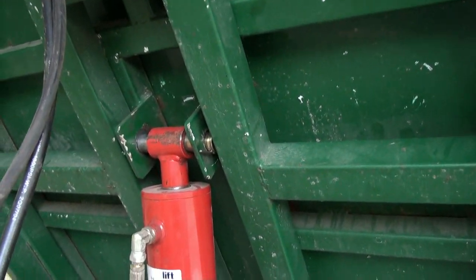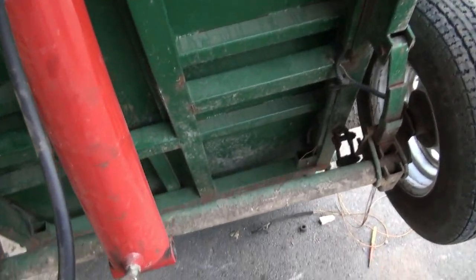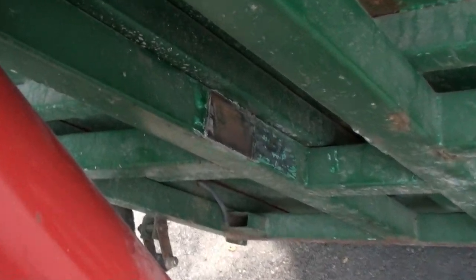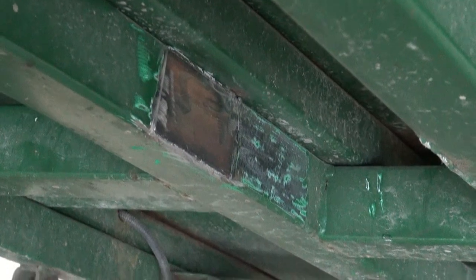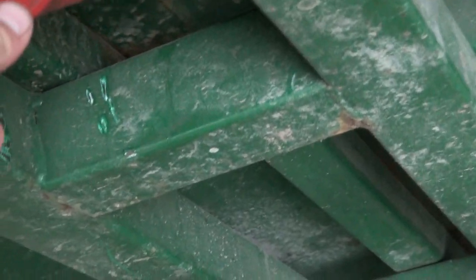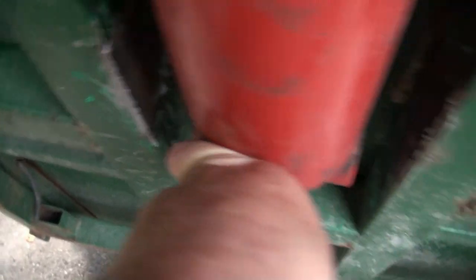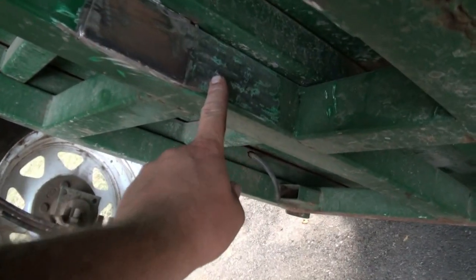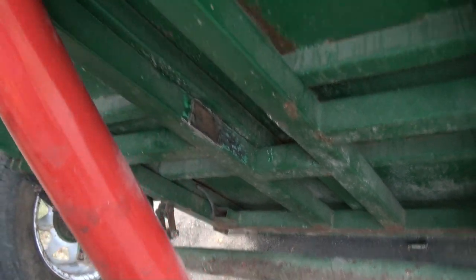I got the clever bright idea because I had the loader hydraulics on the tractor, so I just run it up and down through the black box up there, and these hoses that come out here go up and down. Problem was, where the plates for the bottom mount holes were mounted — they were for the other ram, not for this one. You can see they need to be back quite a piece. They need to be down in here, but they were up here. So what had happened was she was sitting sort of angled, and it left the box of the trailer up quite a bit.